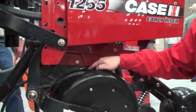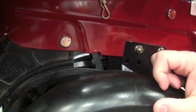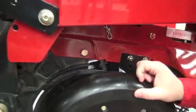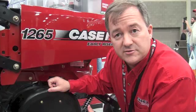Also, inside the row unit, behind the disc openers, we only use a 10.5 degree opening angle. This allows us to not put so much force on the soil in the seed trench. That way roots of young seedlings can better penetrate and find water and have rapid early emergence. In addition, we don't have W bottoms by the nature of our row unit as much as alternatives. We have a nice clean seed trench.